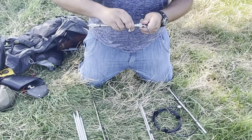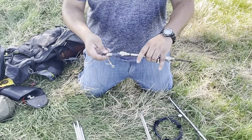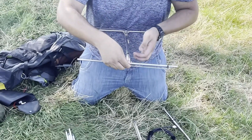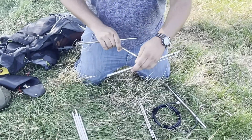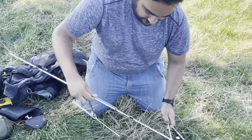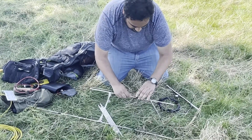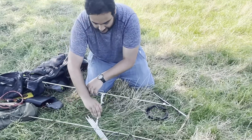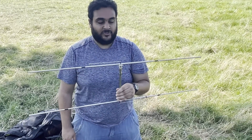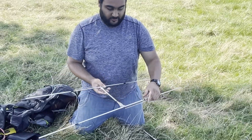It's very simple. All you do is screw the antenna elements into place — they use SO239 and PL259 connectors. The thing to watch out for is to have the gamma matches opposite each other, because that's how the antenna works. Push the elements in carefully, as these are a little bit fragile. I had one break the second day I bought this antenna, but Wemo were nice enough to send me a new one free of charge with free shipping. Just be wary of the gamma matches — they might be slightly fragile.